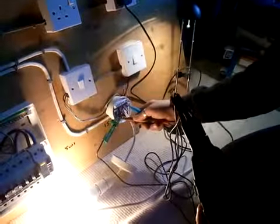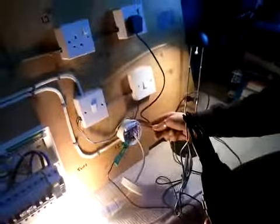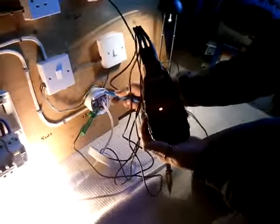And we're back live again because a tripped circuit breaker would be the only problem. The only other fault I can think of doing is just connecting the live on itself. Now it says live and earth are correct, the voltage is correct, but there's no neutral because the neutral light is orange and flashing. So that's a fault you can detect if it's a break in the line. You can't test the neutral and earth together because of the way it works. If you put the neutral on the live, it assessed it, but it says it's a lower voltage and it's also thinking that there's no earth at all, and therefore the circuit is failing.